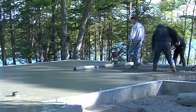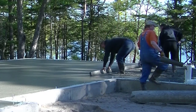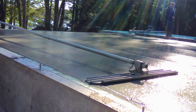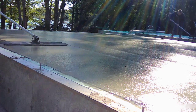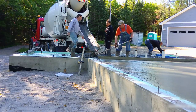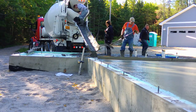These are the types of floors we pour a lot of — inside foundations. I know you guys down south mostly don't have foundations; it's mostly all on slabs. We do a lot of slabs up here too — what we call monolithic slabs, where the edges are thicker with a big beam around the edges. We do a bunch of those for houses, and I've got videos on those too. Probably over half the floors we do have a foundation like this.